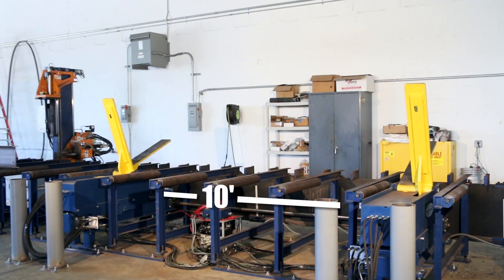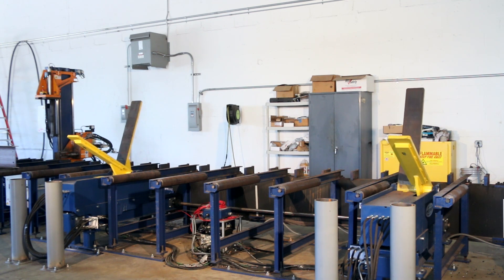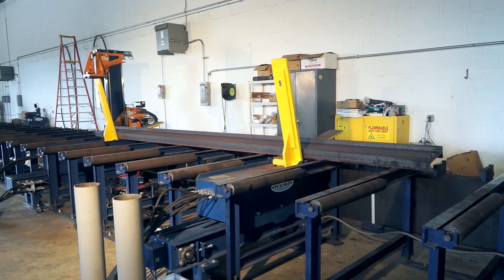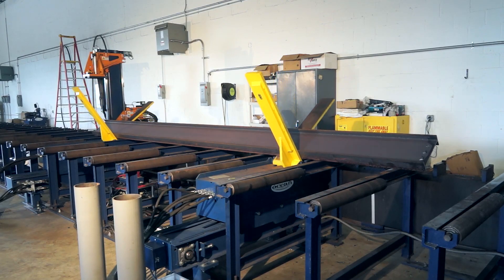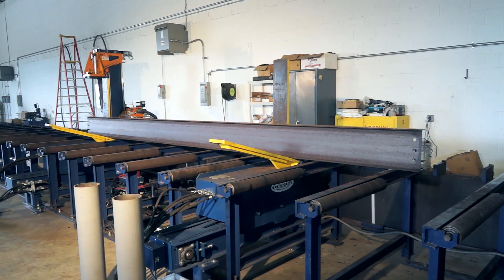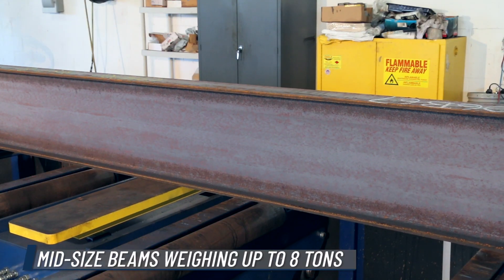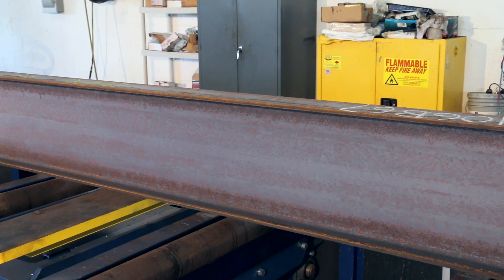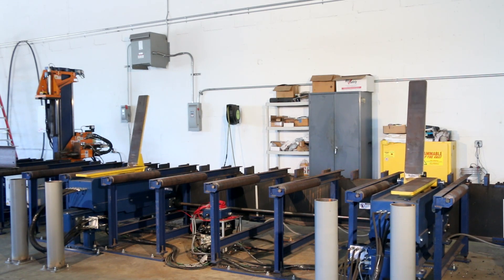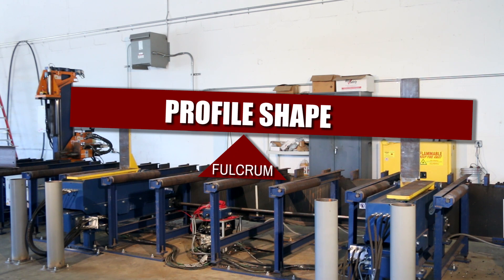The two Flipper elements are spaced about 10 feet apart and are intended to service half of the normal drill line table. A Flipper system comprises a pair of Ocean Flipper beams that handle beams up to 36 inches, up to 40 feet in length or longer, and for mid-size beams weighing up to around 8 tons. The actual maximum lifting capacity is determined by the profile shape and how far the center of gravity of the profile is away from the Flipper's footprint.